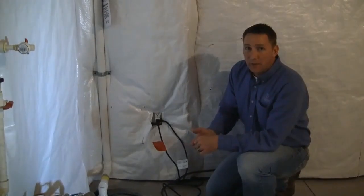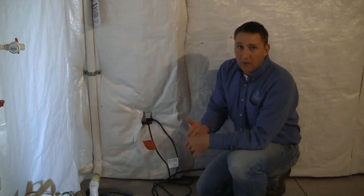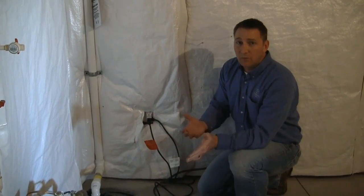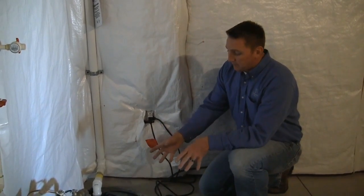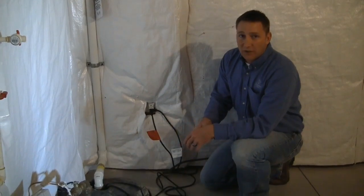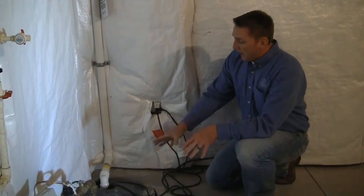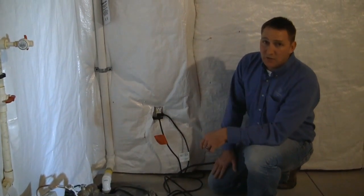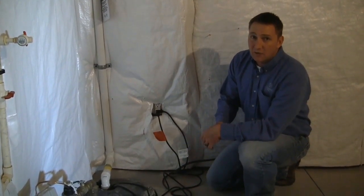While we're talking about sump pumps, we wanted to discuss the sump pump itself. It has an unknown lifespan, so it could last anywhere from one to five years. It's common practice every two to four years to get those switched out, but the biggest thing is to make sure that sump pump has power going to it by checking those GFIs to make sure they didn't accidentally trip.